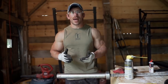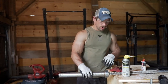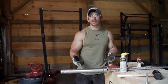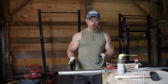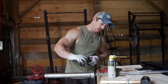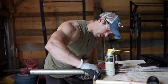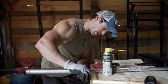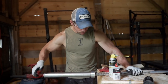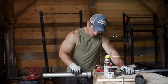One last thing: if you're looking for easy, low-effort barbell maintenance and it's not spinning well, you don't necessarily have to take everything off. You can just take a little three-in-one oil and drip it right on the inside of the bushing, go all around, push it right in there. That puts a barrier between the two pieces of metal, and already we've got it spinning way, way smoother than before.